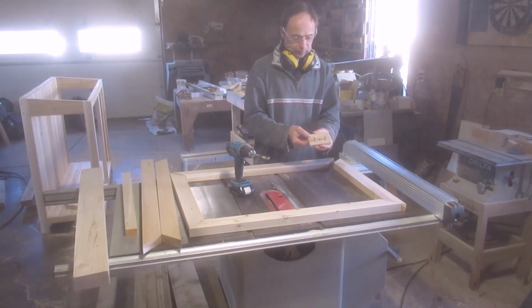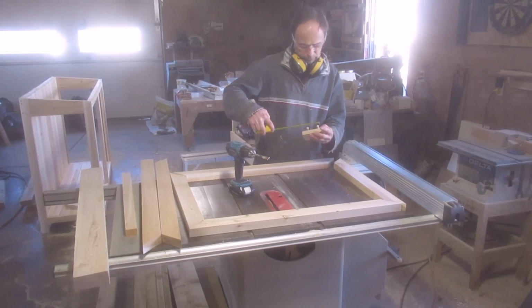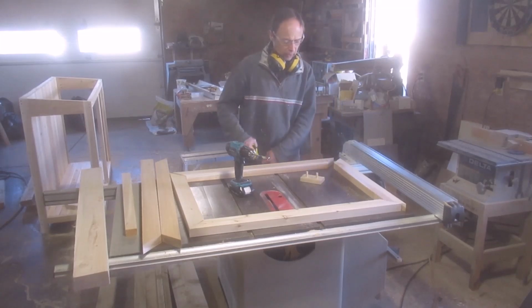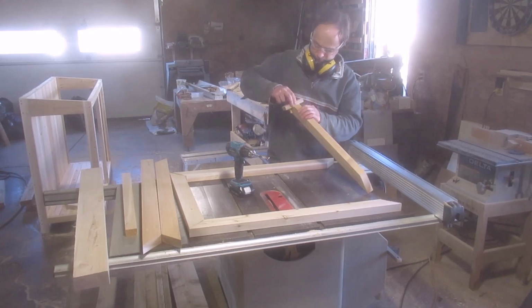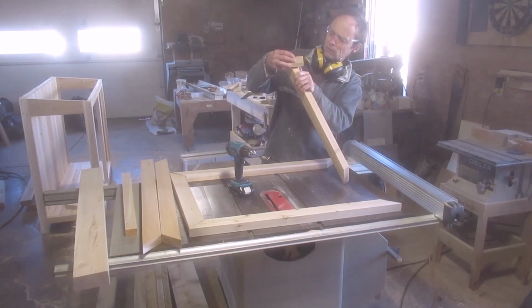Like I said, maybe I was off a little bit. If you look, these are not evenly spaced, so I won't hit the center, right? Or perfect center. Like that way I have a 5/32. This way I have a little less. See, I'm not hitting bang on dead center, but I have to keep the jig in the same orientation to make sure that everything turns out as it should. So I'm just lining this up here. There.